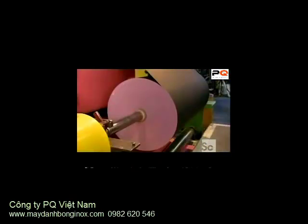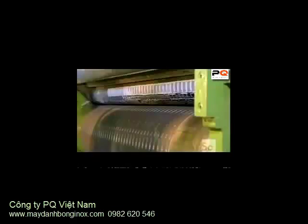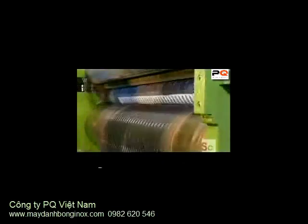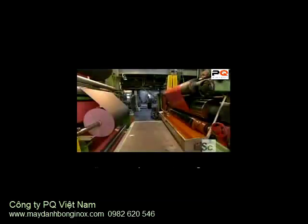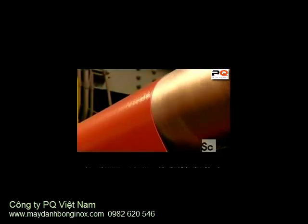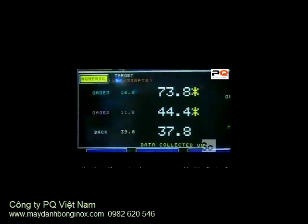Sandpaper often isn't made from paper at all, but fabric like polycotton. The cloth is unwound into a machine with a printing press. Rollers lined with rubber printers stamp product information onto the cloth. The cloth then travels underneath the printing press, where more rollers apply a heat-setting adhesive to the unprinted side. A computerized system measures the density of the coating to ensure that it's been applied correctly.